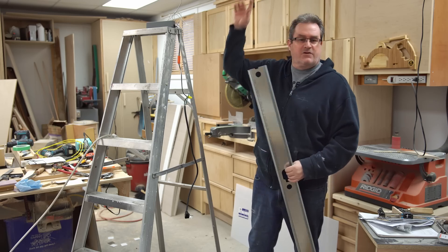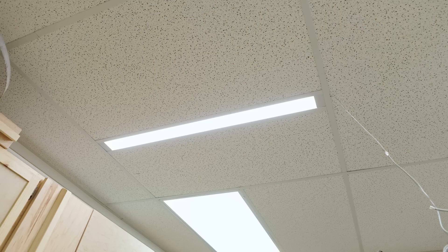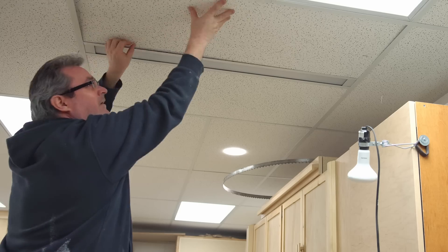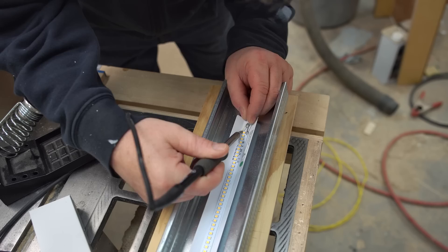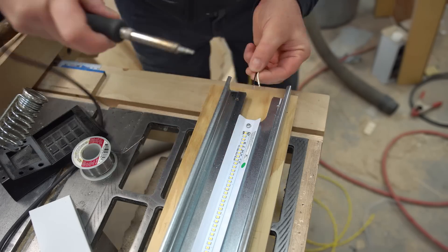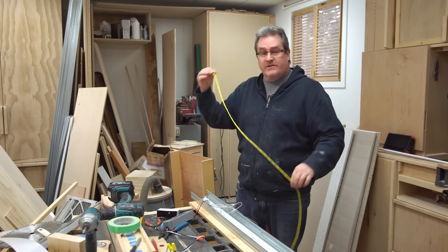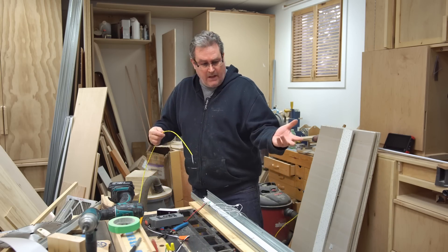You can see up here there's an extra cross T beside the fixture to finish it off and support the ceiling tile on the other side. There are also a couple of things I have to do with this fixture. The first is to take off the stock wire and solder in a longer one. I'm using 18-gauge wire here, so I won't lose any current from the power supply over to the light strip.